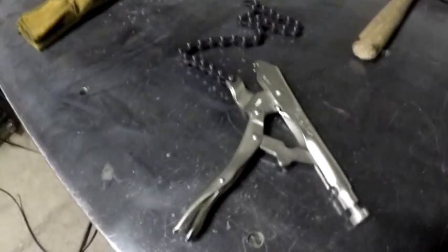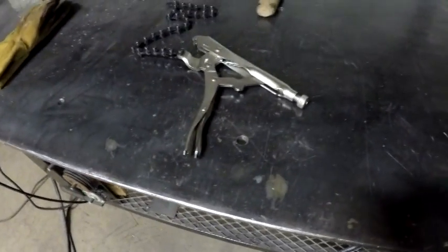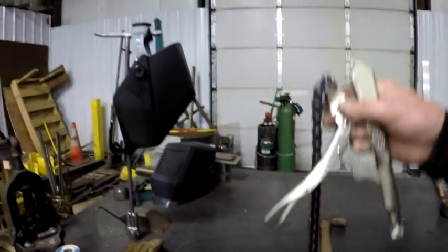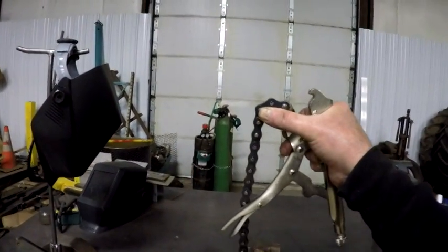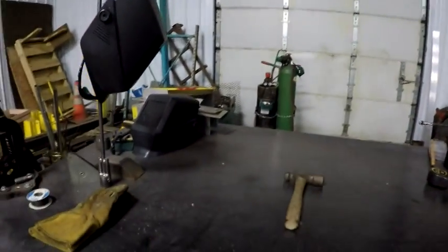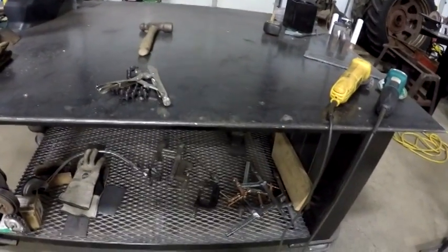to hold a bushing for hole saws, so that you can clamp that around a pipe and drill a hole saw down into the pipe. When I say that block is going to be on there, there's also going to be a leveling system so that you can level the block or the bushing holder. You could level it, clamp it on, and level that block on top of the pipe, and then drill with the hole saw down into the pipe. It'll have two-way levels so that you can do it on the top or bottom of the pipe if you want to.